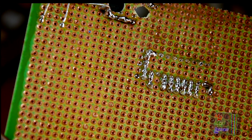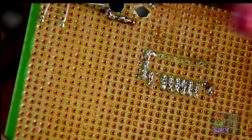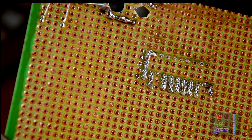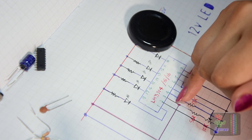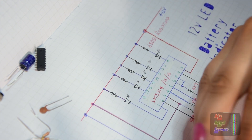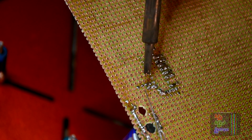All the terminal pins are connected now, so I can just connect the wires onto that. I'm going to have the resistors right next to the LEDs on the separate board that will be joined onto this. Pin 3 here is plus volts, so I'm making it go to here — this is plus volts.